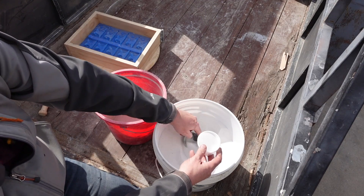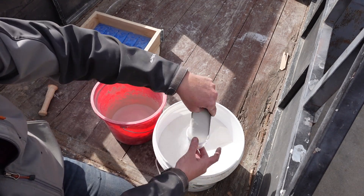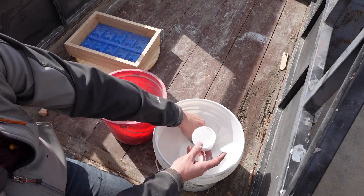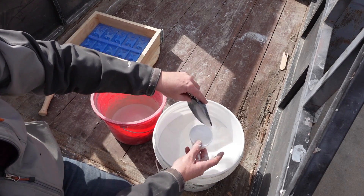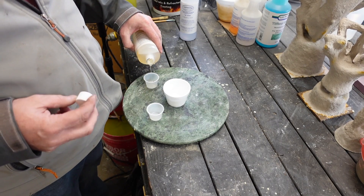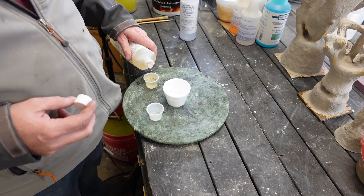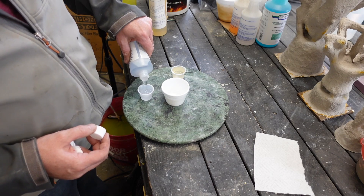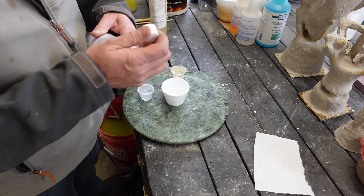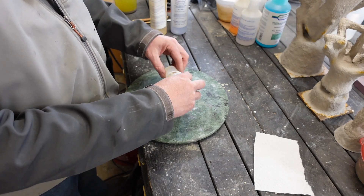To make our resin-bonded sand, we're going to do 15 parts sand — this is just a sandblasting media I had, really fine grain, it was the best I had at the time. That's 15 parts sand to one part epoxy resin. This is Amazing brand epoxy resin; you can get it at Hobby Lobby, and I'll leave a link in the description. I believe they also sell it on Amazon. We'll get equal parts and mix that up.